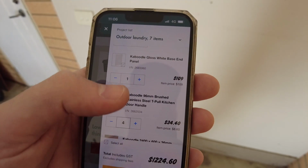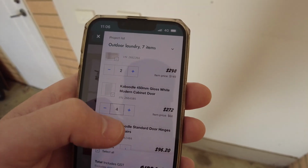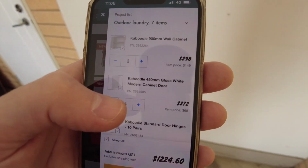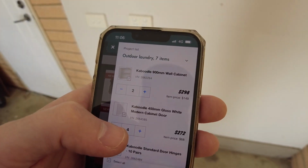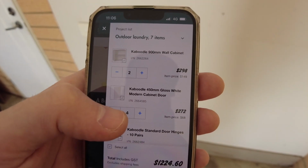Now I've still got to obviously put in some more pieces there. I've got to put in the base cabs. But what I want to do with the base cabinets, it always looks better if you use the same size doors that you do with the bottom of the cabinets to your wall cabinets that you put at the top, and you try and run the lines straight.